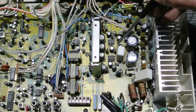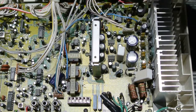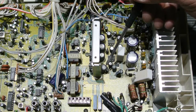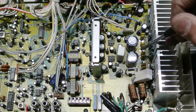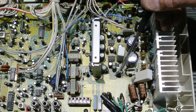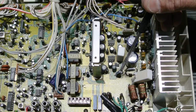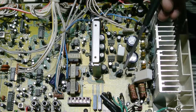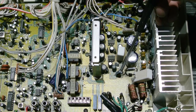Now you can see this one right here — this is a little 47 microfarad, probably 35 volt cap. This cap has been replaced. This one, this one, this one, all of these in here, all the ones in this section, and the big 6800 cap I just took out — these are all still original from when this unit was manufactured. This cap was replaced because it failed, and it was replaced on August 21st, 2001. This was the part that was replaced at Newtone when this unit was sent in for repair.